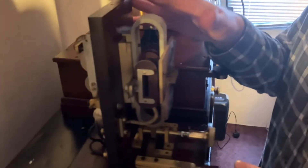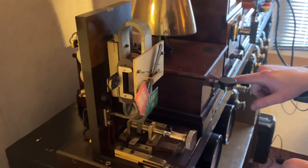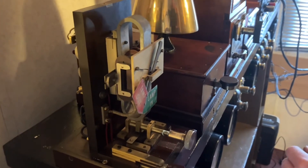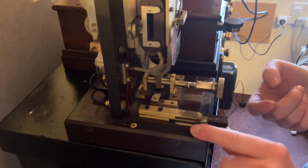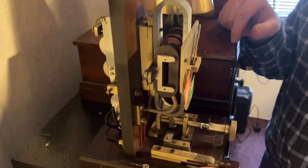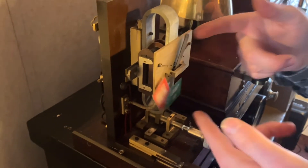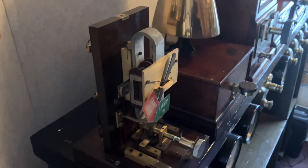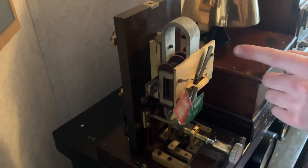We've had a brief look at these on the IRSE minor railway section previously on the Facebook page. At the front is the indicator unit. What happens is the pyrometer circuit comes in from the battery and signal, through the pyrometer, back through here into the line contact. It will then flow through this switch — which is a test circuit switch — and then through the coil and the coils of the relay, and then go back out to the pyrometer. In the event of that circuit failing, because this is a normally closed fail-safe system, the flag will automatically go to lamp out and it's weighted to that position. So even if the power fails — which we can demonstrate now — a few seconds later it will start dropping off.